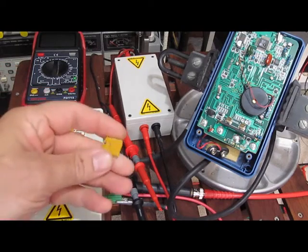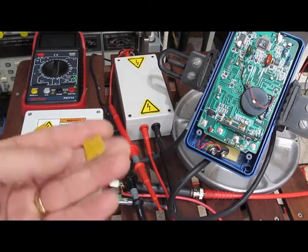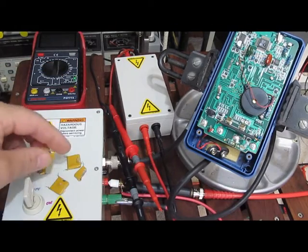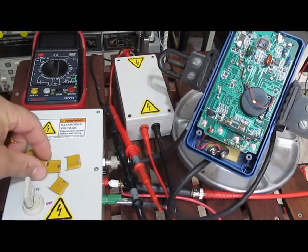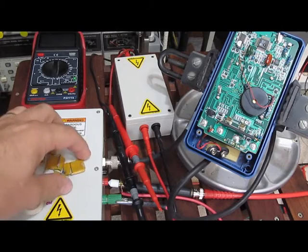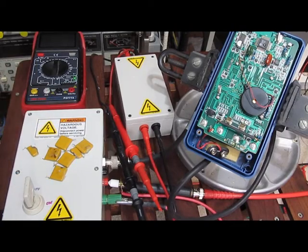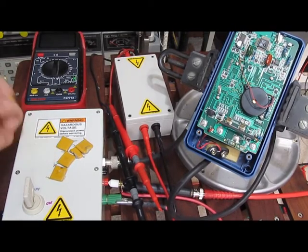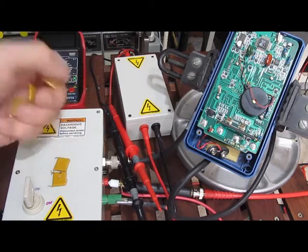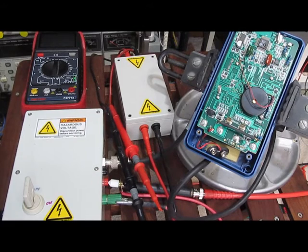So far things have been going pretty smooth with the meters. I made an attempt to up the voltage on my generator a little bit too far and I cracked several of the ceramic capacitors in it — one of them actually split in two. I had to go through, identify which ones had failed, and replace them all. They're all hot glued together; there's quite a few of them in this box — that's how I make up the storage. Those have all been replaced and the unit's back up and running. I've dialed it down just a slight amount, so we're now running about 3.5 kV. Seems quite reliable — it's well within the working range of the caps.